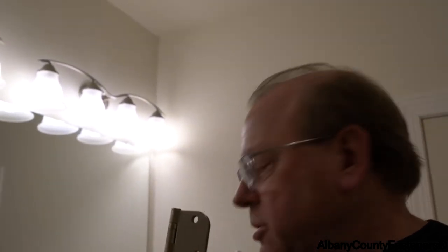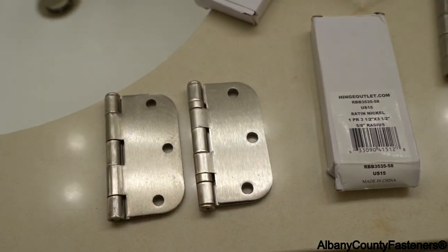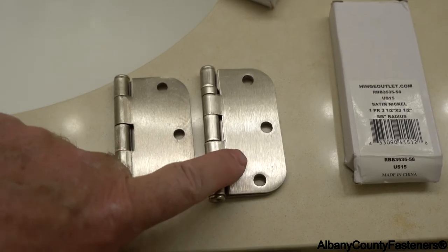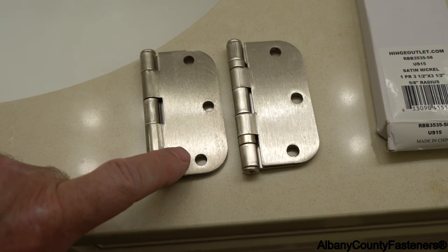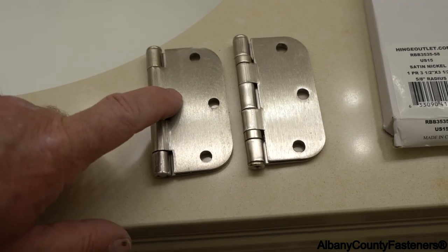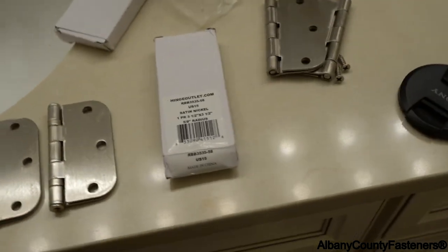Recap: these are your old hinges, which have no bearings. How can you tell? Hinges with bearings — you can see these are the two bearing points. These are hinges without bearings — just standard mortise hinges. And that's really it right there. I'm just giving you some close-ups so you can see the difference.